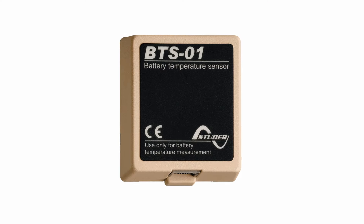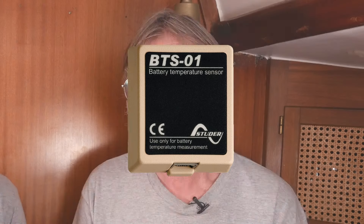Excellent question and I see these temperature sensors over and over again in the wrong place where they're actually doing no good. We have two types of temperature sensor. We have one that bolts to the battery post — ideally bolted to the negative post rather than the positive because the negative plate tends to generate more heat, but it really doesn't matter. Then we have the type that sticks onto the battery case, and I see those repeatedly stuck on the top of the battery.